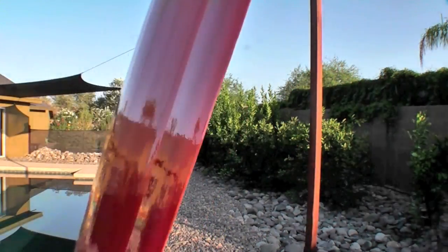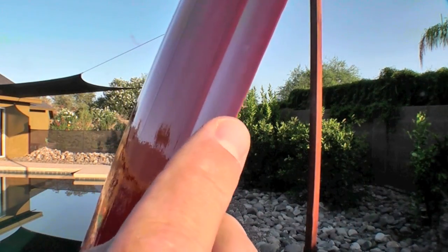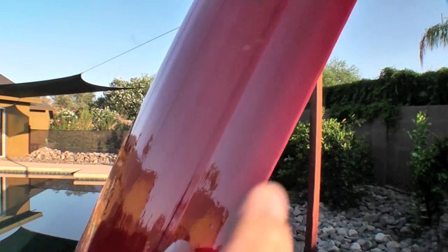With attention to detail, you can make the upper surface of the wing and control surface one smooth contiguous section, which is incredibly aerodynamic. The trailing edge done with the kissing tape technique makes a thickness of only two thicknesses of packing tape — that's only four thousandths of an inch thick, just like a knife edge right there. The lower surface does have the hinge, but it's still pretty aerodynamic.